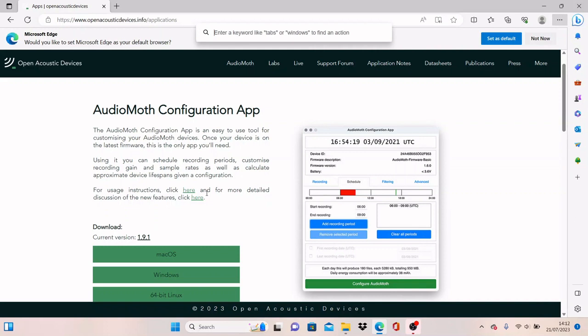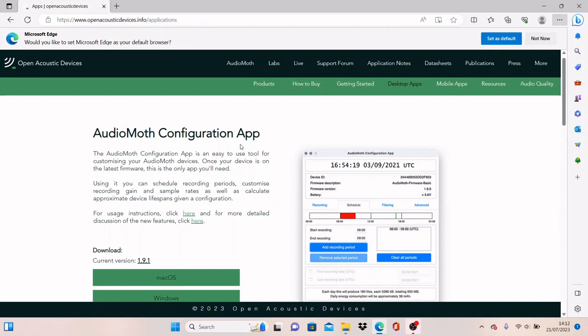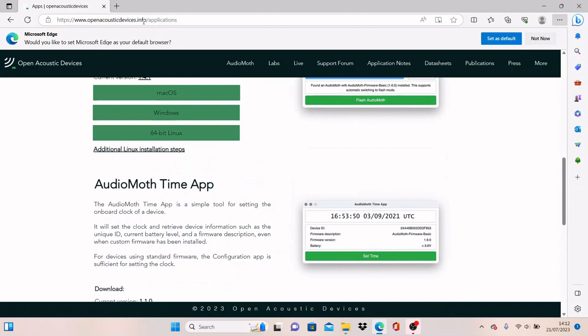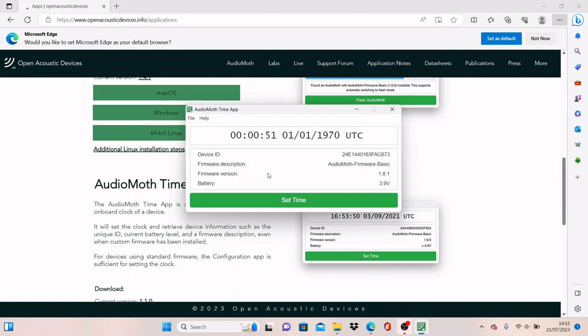Hello, welcome back. In this portion of the video I'm going to be showing you how to calibrate your AudioMoth before you deploy it for recording. The first thing you need to do is go to the Open Acoustic Devices website and download the AudioMoth configuration app and the AudioMoth time app that we use to calibrate. The URL is in the top there if you're having trouble finding the website. The AudioMoth time app is quite nice to use — it's only a single button. All you need to do is open it, it'll bring up a window, and if you hit 'Set Time' it will set the time to correlate with the time on your system clock. The only thing you need to be aware of is that if you have daylight saving times enabled on your computer this might look like it's an hour behind — you don't need to worry about that, it's not a big problem, just don't be alarmed if the time isn't what you expect it to be.